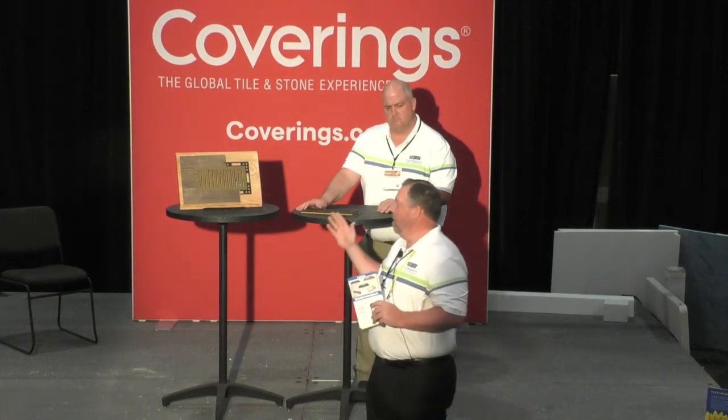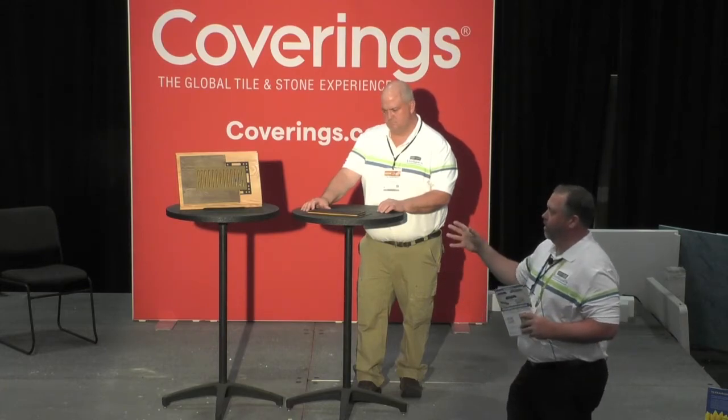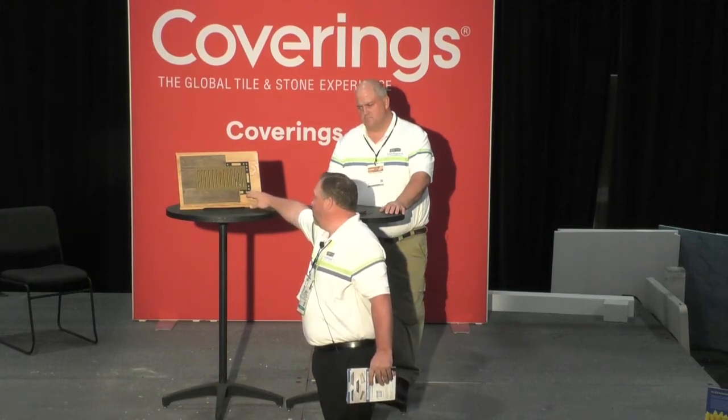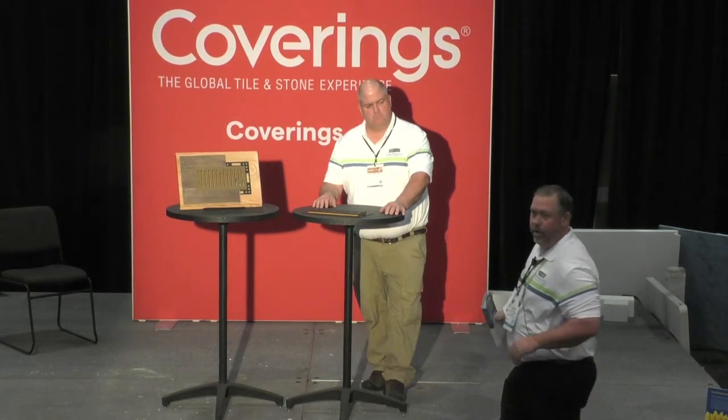Most people when they're buying their homes and picking out their flooring, this gives them a nice higher-end option as far as the look and aesthetic of the flush mount, whether it's hardwood or tile. For tile, it's pretty simple with the flange design. You can make your tile cuts around it, thin-set right over the frame, and put your tiles right around that too.